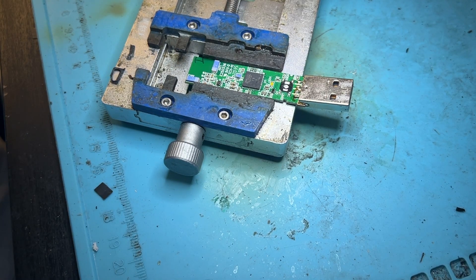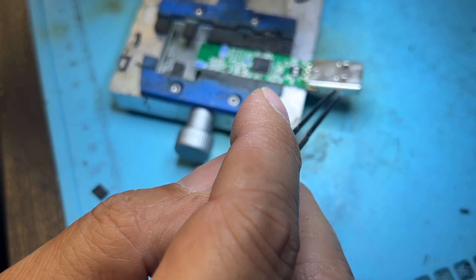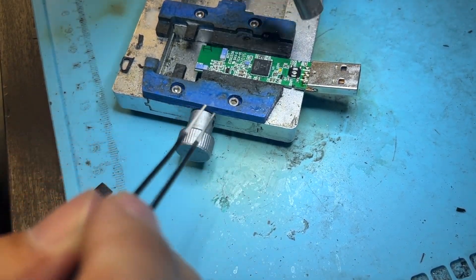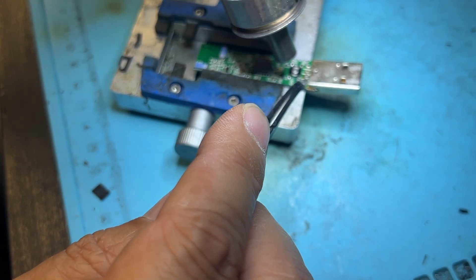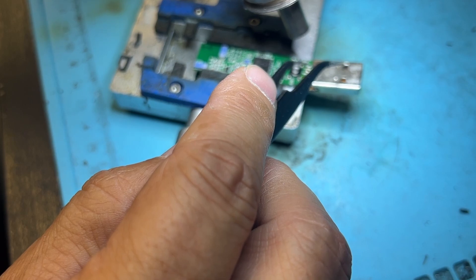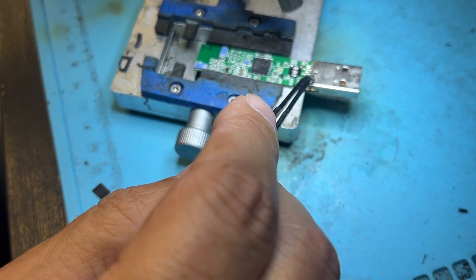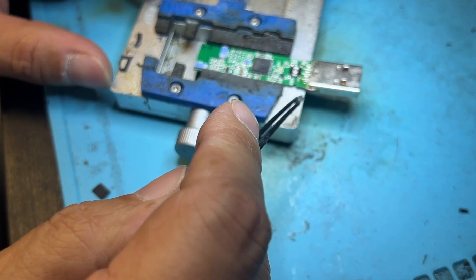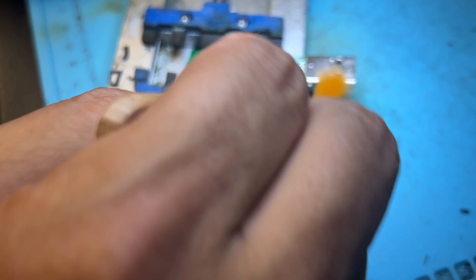I got the port on it, but as you can see it's not level — it's raised up a little bit, so you don't want that. What I did is use just a light heat around there just to soften the solder until it kind of gives in, so it becomes level. I'm applying maybe 310 degree heat gently so I don't want to disturb any other components. Just feel just enough heat and keep on tapping it until you feel that the solder softens up for that USB port to kind of cave down a little bit. You can see now it's perfectly level, which is the way you want it. After that, you can clean that up. Make sure the joints are good, then it's time for test.